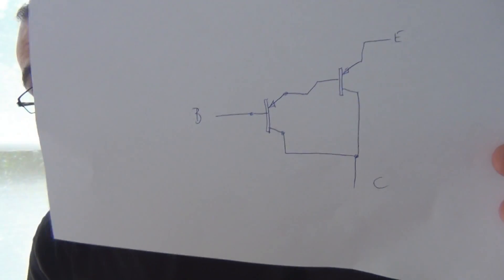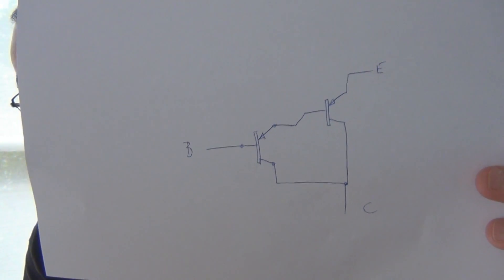If you like the sound of low-gain fuzz faces, that's great, but low gain won't sound the same as recommended hFE, and recommended hFE won't sound the same as really high gain transistors. So if you want to turn two very low gain, basically unusable transistors into something very usable, you can use a Darlington pair configuration - two PNP transistors tied together. Look up the NPN version on Google Images if needed.